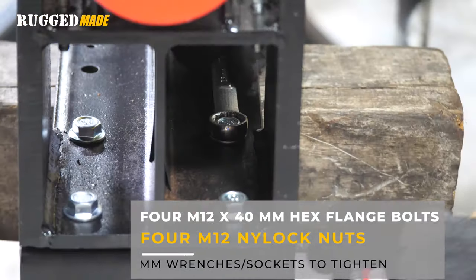Use one of the elbows with three quarter inch NPT on one end and half inch JIC 37 degree on the other. Apply thread tape to the NPT end and install the fitting in the port on the rod end of the main splitting cylinder. Connect a half inch ID high pressure hose — be careful not to over tighten the swivel collar. This hose and fitting should be installed before the valve platform because access to this area will be difficult once the platform is mounted.